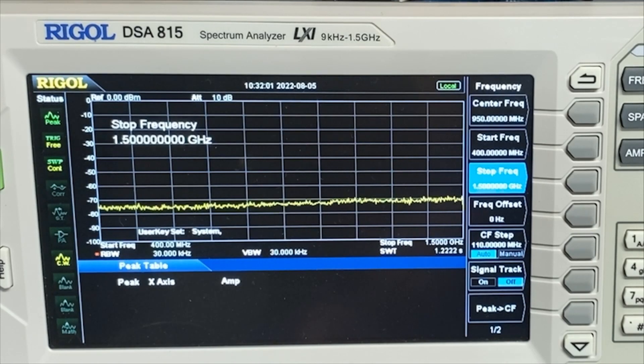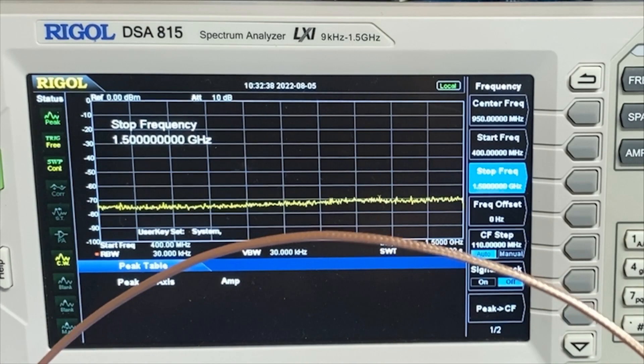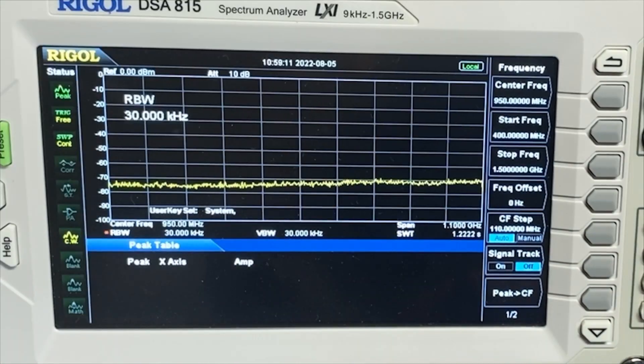But we're looking for harmonics, and a harmonic of 446 — the first harmonic is going to be 892. This spectrum analyzer only goes up to 1.5 gigahertz, so if we're looking for those harmonics we need to have our sweep range as wide as possible. With the VHF frequency we can see the second and third harmonics under 500 megahertz — it might even go to four, I'd have to do the math. But in any case, to do UHF we need to open this up as far as this particular spectrum analyzer will go, so the only one we'd really be able to see is the second harmonic. Okay, so now we're set for UHF.